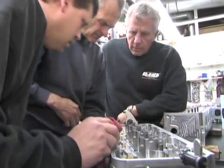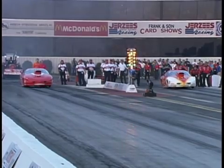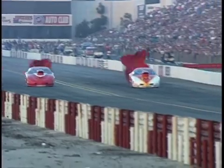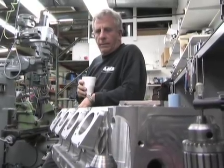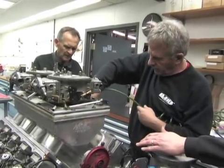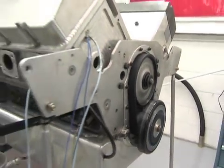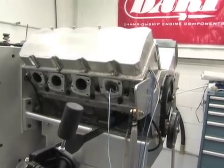In 1986 or '87, the Dart 2 head came out, and that head hasn't been changed since I designed it in 1986. By the time we got to building the 1997 version, we'd won quite a few Pro Stock races, won a championship, and all that input went into it. Although the head still fits on the same engine and uses relatively the same size valves and components, the power levels the head can produce are up about 100 horsepower since what I learned in 1981. Essentially what you're looking at is a painting that we're never going to finish as we keep working on these heads.